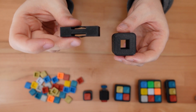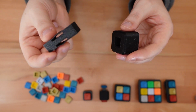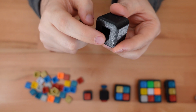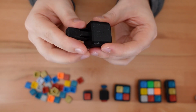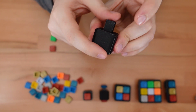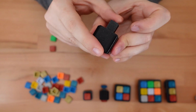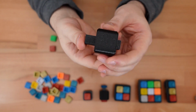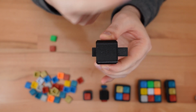The first step is to slide the spring into the frame. Just make sure that you orient the spring so that these sides that flex line up with 2 small chamfers on either side of the frame hole. If you put it in the wrong way, the connection will be too tight, and there won't be any snap action. Instead, this piece will just fly out the other end.